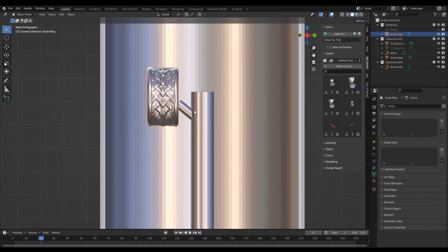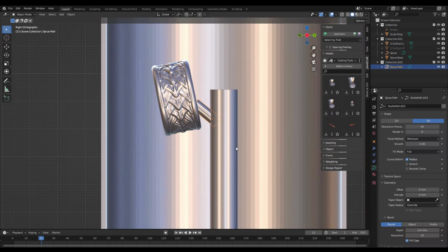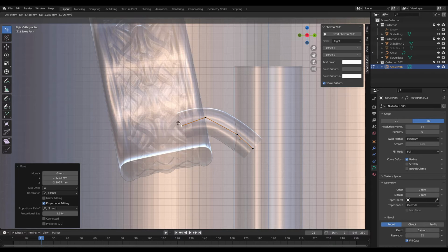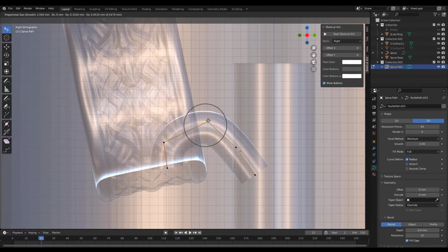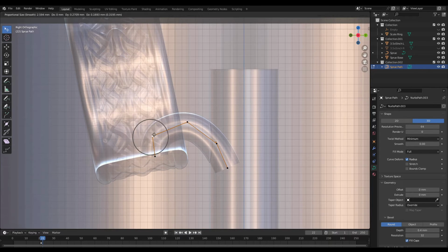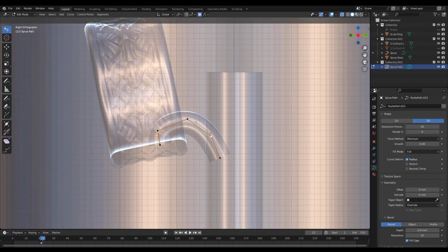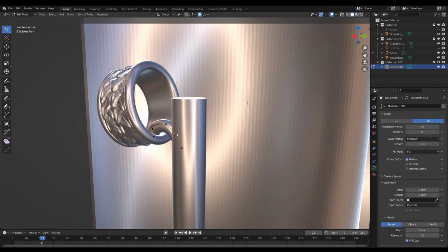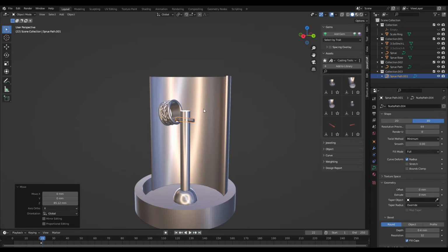I know it can be a little confusing because we're technically looking at the flask upside down from how it's going to be placed on the vacuum table for casting. But with these sprues, I'm trying to keep in mind how the molten metal is going to flow through that main channel and go into the ring cavity. And my aim is to make as smooth of a transition as possible for that bronze to flow.